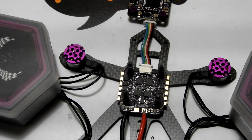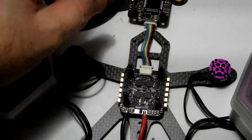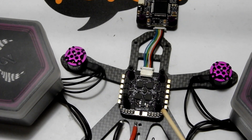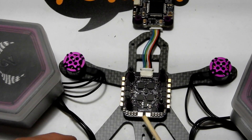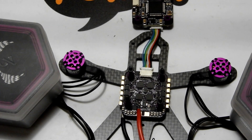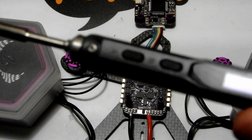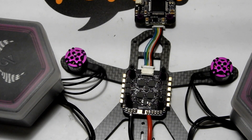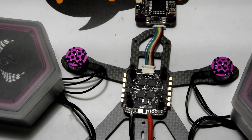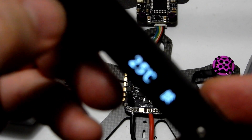Once we've got our wiring we can flip it back out of the way. I've mounted it but I keep the nuts nice and loose — don't put them all the way down to the board or the board will just keep falling off. That also keeps the nuts out of the way because when you're soldering they're so close to the board you'll often end up hitting them with your soldering iron. Let's line this guy up, pre-tin the pads, and get our power supply on. I have the TS100 — if you've ever wondered why you hear so much about how great it is, check out the heat time on this guy and how quickly it gets up to heat.